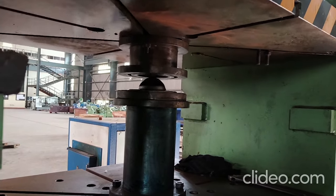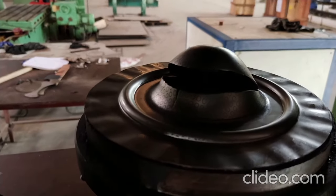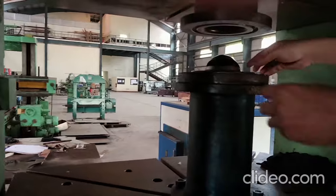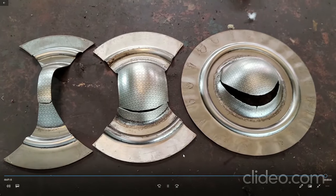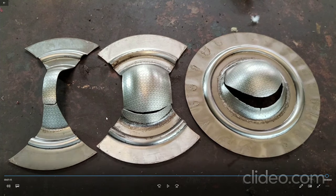The sheet is clamped fully and here also the sheet is fractured, though it is too much fracture — one should be able to stop it just at fracture. Here also you can see that the circle grids are deformed into ellipses. So all three sheets are deformed now. Similarly you can have a few more strain paths between the left and middle, and middle and right, by increasing the width of the sheet to simulate predefined strain paths.